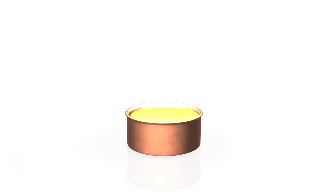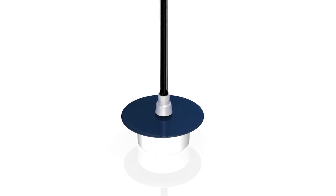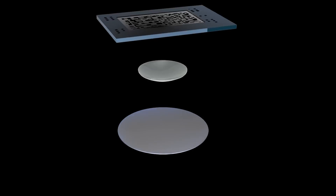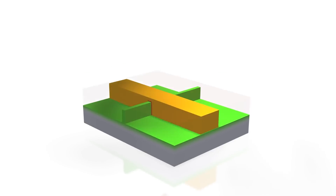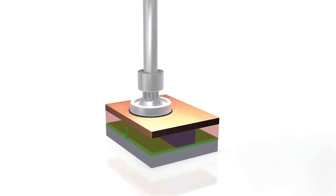The digital micro-mirror device is a micro-opto-electro-mechanical system — a goofy but accurate name for baking optical elements and moving mechanisms right into an integrated circuit. On a very high level, integrated circuits begin as a thin wafer of silicon. The fabricator lays down a film of a metal, mineral, or polymer mere atoms thick, then precisely engraves details using light, chemicals, and light-activated chemicals. They repeat this over and over again, stacking up and carving out millions, maybe even billions of tiny components.